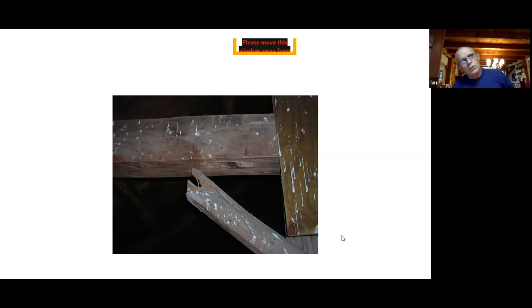When I'm doing an evaluation of a barn, the first thing I'm going to do is look at the basement and the foundation, but then I'm going to set up a laser level that shoots a line through the barn and measure down from a common joint in the timber frame. That tells me which posts have dropped. I also look at the joinery, and if it's pulling apart badly enough that I'm concerned about structural integrity, that automatically tells me I'm going to have to pick up that barn to put it back together again, pulling the joinery back with come-alongs and replacing missing pieces.